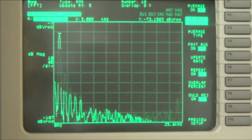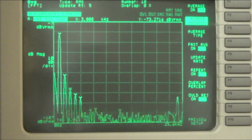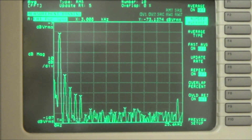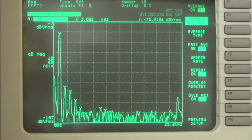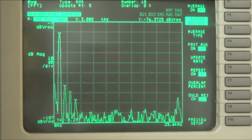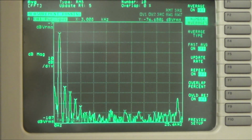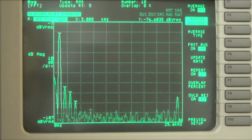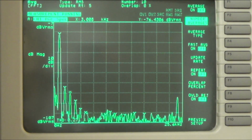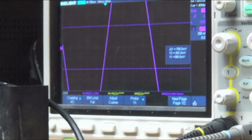And this isn't that much volume. We can take a look at it when we crank the volume, but yeah, I consider that to be pretty cool. Yeah, and there we got it all the way down to 0.2%. And it doesn't seem to be changing too much more. So that's great. That shows you that the feedback's all working, and yeah, there's our wave all nice and clean.